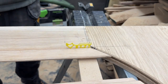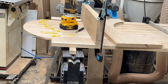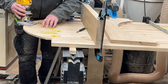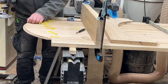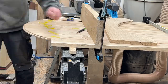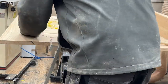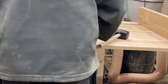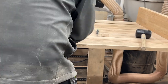I'm using 1mm spacers for any expansion and contraction of the door across the width, and there are about nine or ten slats. You can also see the routed curved head and I use a block plane to put a little chamfer on the top edge so the slats go into the head with a nice V-groove pattern across the top. It came out well but was hours and hours of work — a true labor of love.